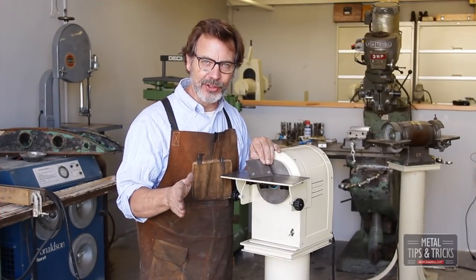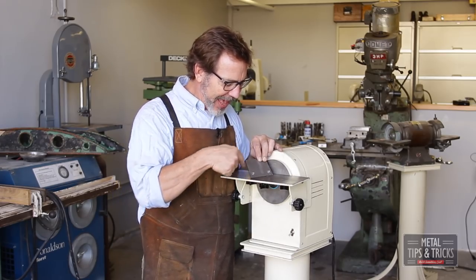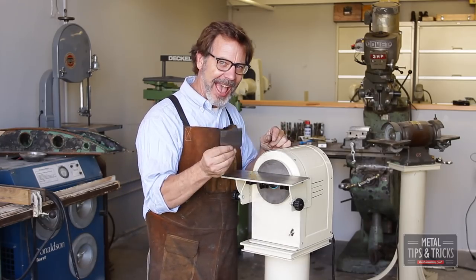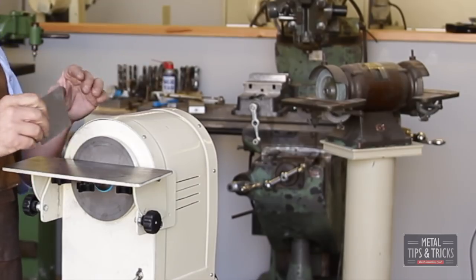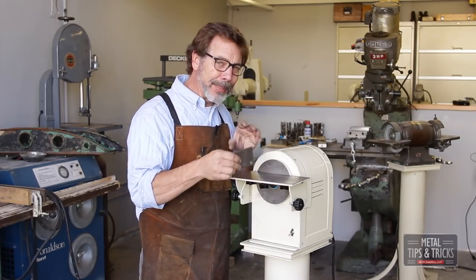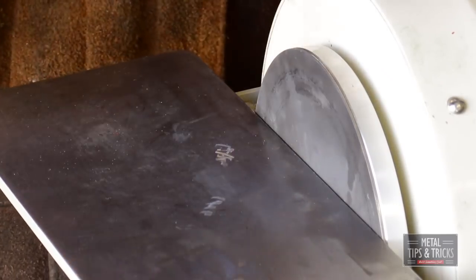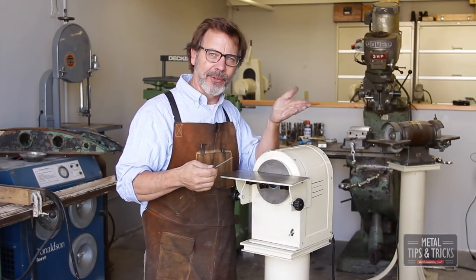Here's something you may want to build for your shop, especially if you build one of these grinders — you want to have repeatable angles. I built a little gauge with a five-degree angle and a three-degree angle for setting up the table. If it's off plus or minus a half degree, it's not the end of the day. I can also use it on another grinder to pre-grind and then come over here with the exact same angle. Because of how it's set up, I can get a positive or negative angle — positive or negative five, or positive or negative three.